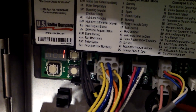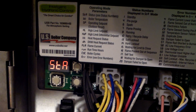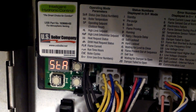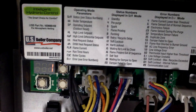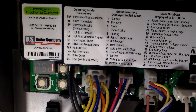Just run at the default settings, but you can check and see what is wrong and it will tell you. As I was saying, there was something wrong - short cycling - and it gave error code ERR4. Number four means flame current lower than threshold. That was my problem because the flame sensor igniter was not working correctly.